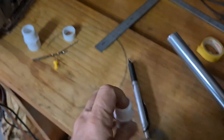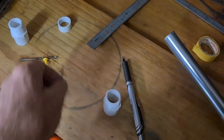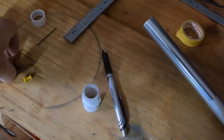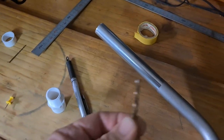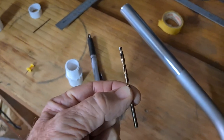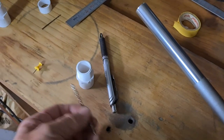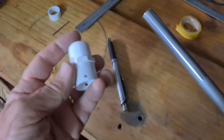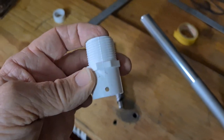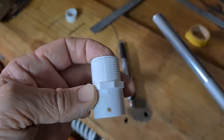Then I grabbed a little push pin and pushed it in exactly where the lines intersected. I used a small 1mm drill bit to make a pilot hole, then got a 3.5mm bit — which is what's required to drill out your bars. I do suggest getting a brand new bit, nice and sharp, as it makes the job a lot easier. Then I drilled the 3.5mm holes through the PVC.